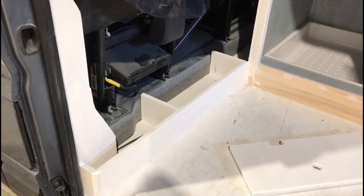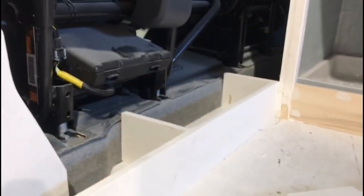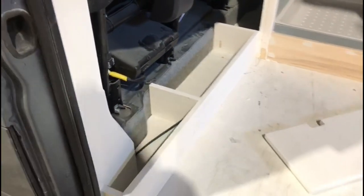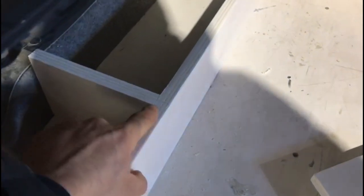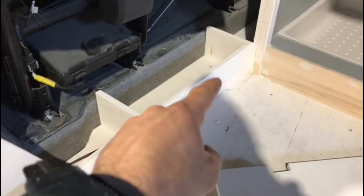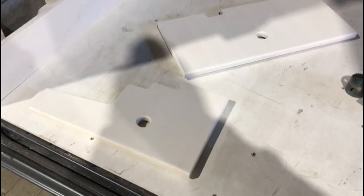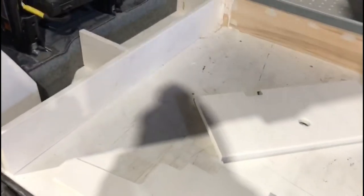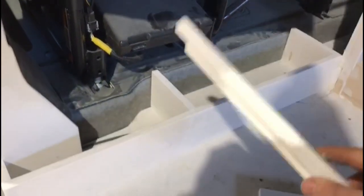Here's the structure for the storage step which sits just behind the cab area. It's 13 centimetres high — in line with where the cab is raised — made using 18mm poplar plywood. We made it using a face piece and a side piece with two vertical internal structures for strength, plus two lid pieces with a 30mm hole saw cut for a finger to lift them on and off. On the underside of the lids we've run some 12mm plywood strips a couple of millimetres in from where the walls are, so when it slots into place it doesn't move.